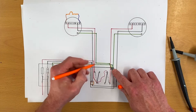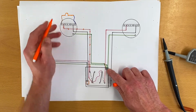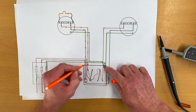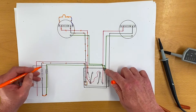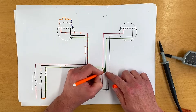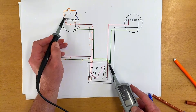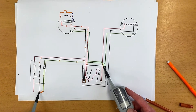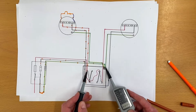Coming up the switching line conductor, we go round and find it comes through the lamp, then down the neutral as a path. Where does that neutral end up? It comes all the way down to the connector, goes back to the consumer unit, goes through the double pole switch which is closed within the consumer unit, and we know eventually that neutral will be connected to the CPC. So we're back on the CPC's run, coming back to our earth terminal. When we probe between our switching line conductor and our CPC, it was the lamp being connected that meant the switching line passed through the lamp onto the neutral, which connects to the protective conductor in both TNS and TN-CS arrangements.